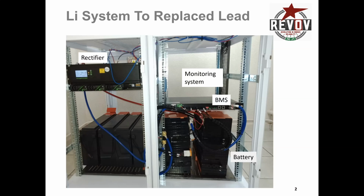Yesterday, I did have a client say to me, we have so many cables now because we're actually using 50 mils all the time. Can we somehow use these smaller cables in a site? And I said, yeah, of course. The terminals that are on the BMS and on the batteries tend to come with 2 bolts per terminal. So there's no reason why you can't have 2 25 mil cables basically doubling up on all the pathways. And you effectively create a 50 mil cable. So they are doing that.